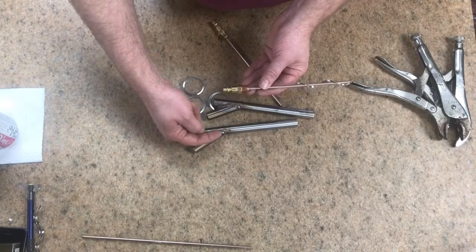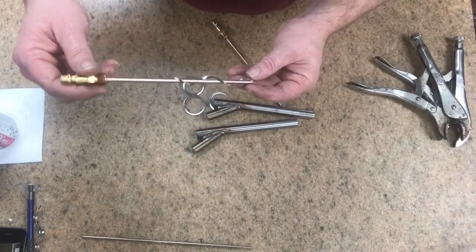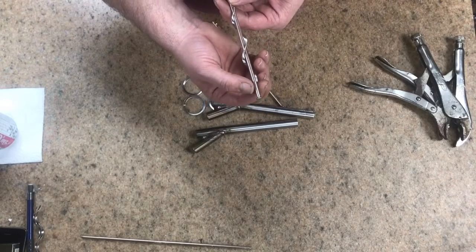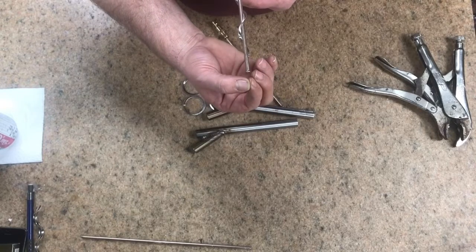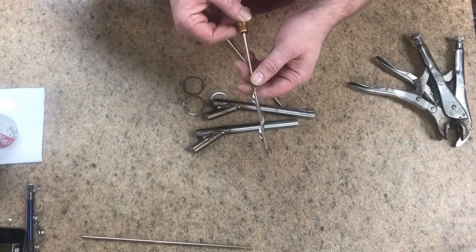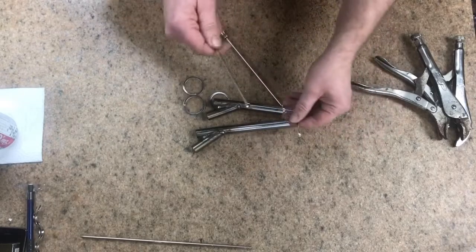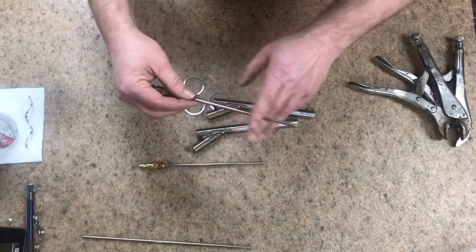The air will come in through the 30-degree angle, come down, start spinning, and since this is flared brake tube there's going to be a little bit of a Bernoulli effect. The air will rush and flow faster around, want to collapse the fuel, and that will start atomizing it — and it will be spinning at the same time. I'll get to doing the extra work off camera and be back when I start to install the fuel pipes into the burn tube.